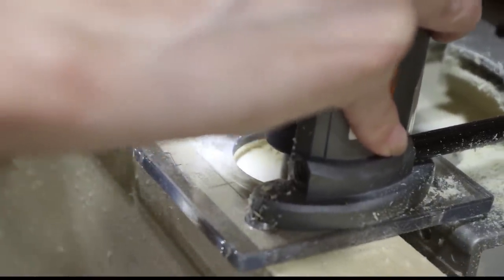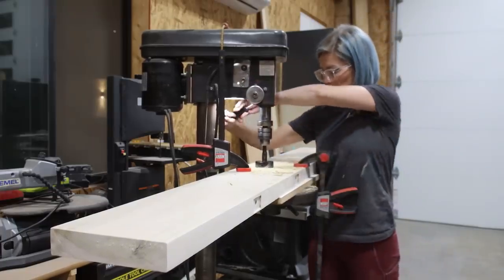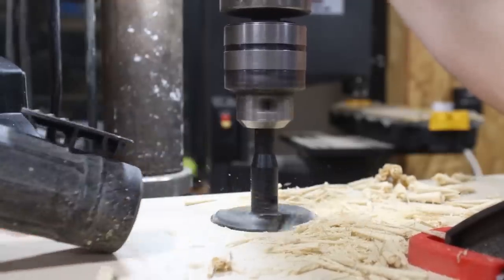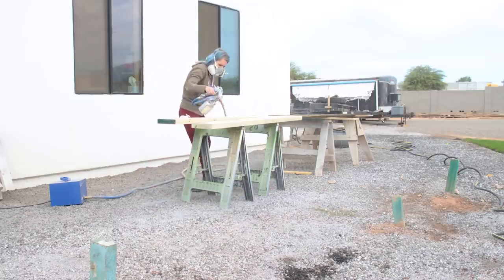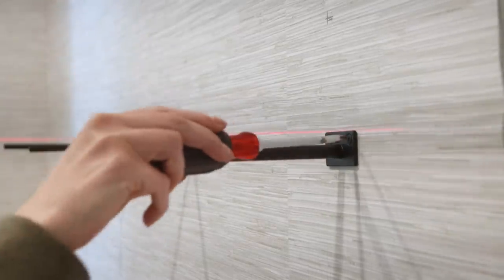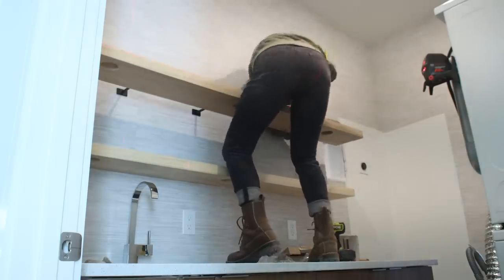I purchased some round puck lights to use as under-cabinet lighting for the floating shelves, which meant I needed to pull out my big two-and-a-half-inch Forstner drill bit. This thing can be a wrist breaker, so I'm really glad Bryce let me use his drill press for the six holes I needed to make. If you don't have a drill press, another option is to create the holes using a router, similar to making the mortises for the hardware. At this point I gave my floating shelves a good sanding and took them outside to spray three coats of a clear water-based finish. Once they were dry, I took everything inside and began to install the hardware onto the wall. These solid shelves are heavy, but at six feet it's definitely a job one person can handle.